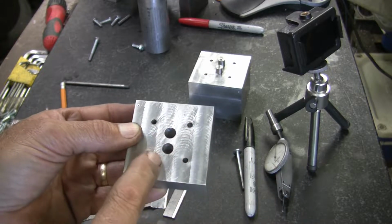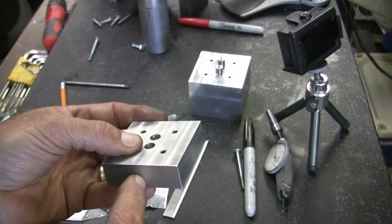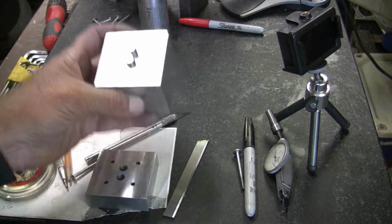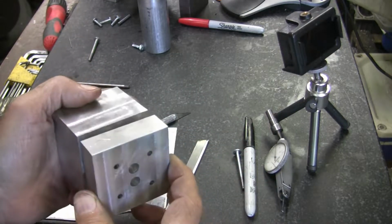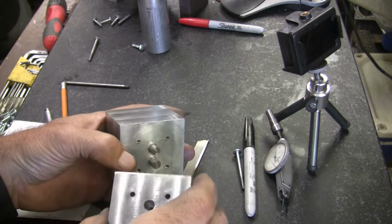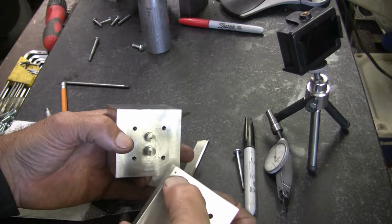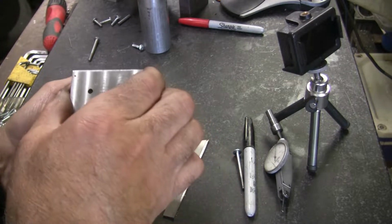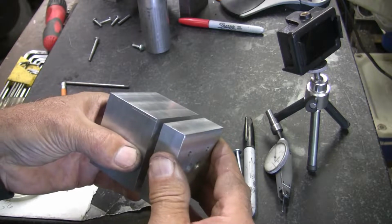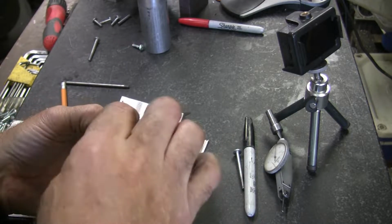So they are basically ready to put the exhaust port and intake ports in. What I did was I made a little holding fixture here that these will mount on. They mount on a certain way to keep them oriented right. I have a little mark in the corner right there, and a little mark in this corner, because that's the way it goes on. And they fit snug, so once you get them on, there's no shake in them. I'll bolt it in place with screws.